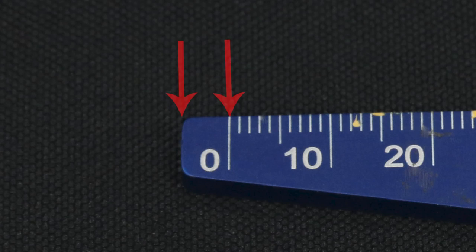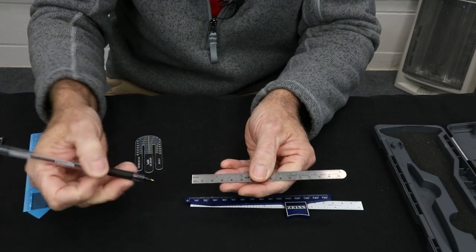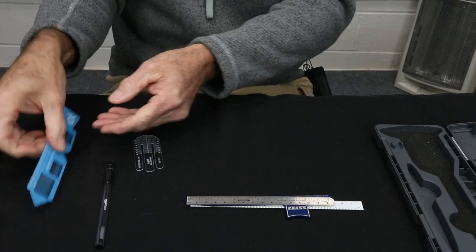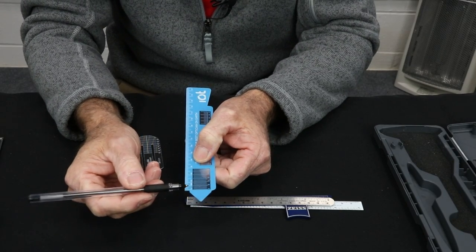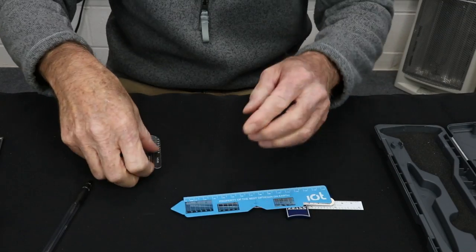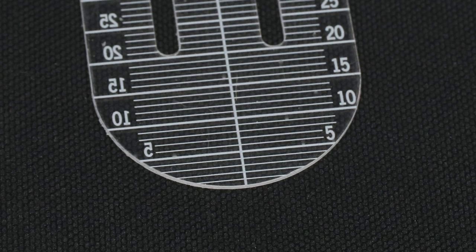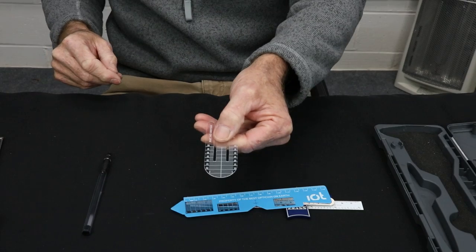Same thing here — there's a huge gap between the end of the ruler and zero. This is one of the rare ones where the end of the ruler actually is zero, so from here to here would be 10 millimeters. Here's another example where you'd be way off if you used the physical end. The seg gauge is a good example of a perfect zero at the bottom, and then five, ten, fifteen — we'll look at how you use those in a day or two.